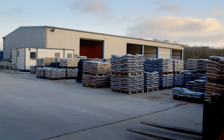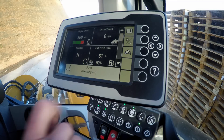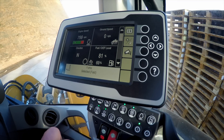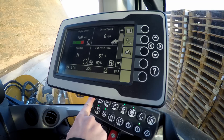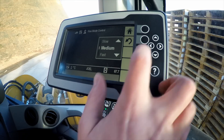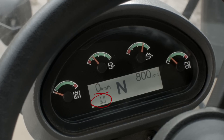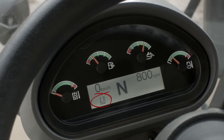Let's put fine mode and perfect parallelism to work here in a pallet material handling application. I can toggle over to fork mode — you'll see that fast is selected. Let's do a push and hold on fork mode, and for pallet work, let's go ahead and dial that to medium.